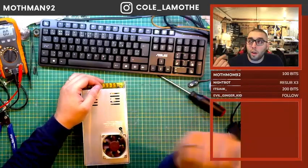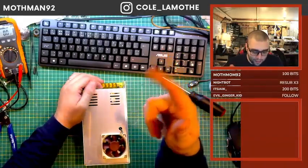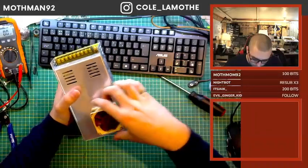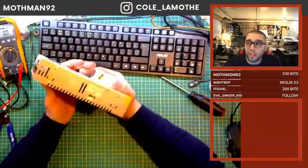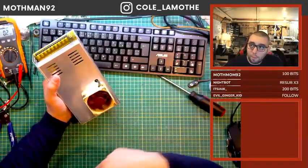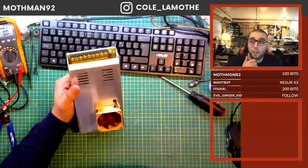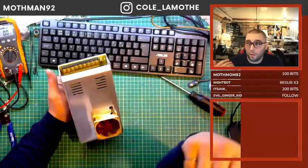Now, I've dealt with stepper motor overheating in the past. I've dealt with main board overheating in the past. And I've dealt with power supply being non-functional. But what I had an issue with on this specific power supply previously was that it was getting outrageously loud. And I put a little Noctua fan on it to quiet it down, right? Now, the problem I've run into, and I have my suspicions, is that the print would go fine for the first little bit and then it would fail.